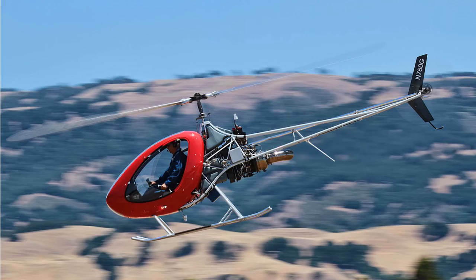The instrument pod is on one side of the seat pan, and the wiring goes down underneath along the frame. If it's one continuous run with no way to disconnect anything, you could never get the seat pan out again without tearing everything apart, and you could never remove the instrument panels. So everything would be permanently tied in place and immovable.